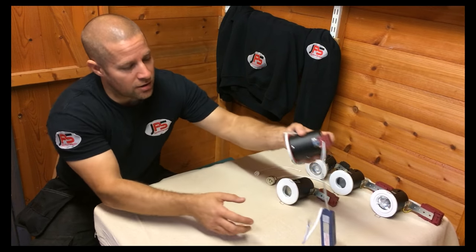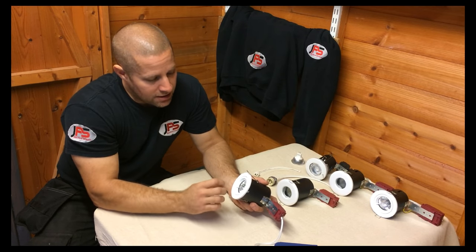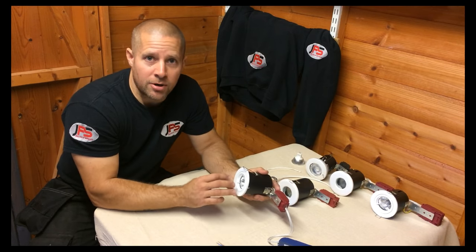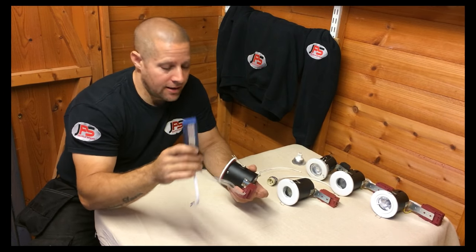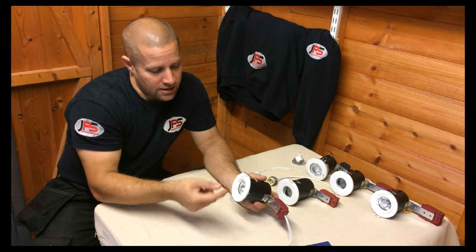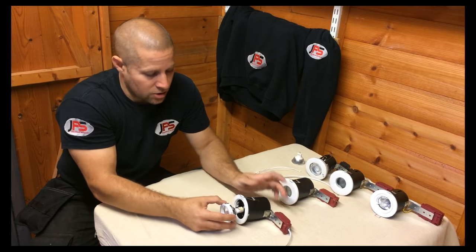So let's have a look at this one — this is a low voltage one. I've got the transformer attached to this one, and the reason I've done this is because sometimes you'll change a light bulb in your fitting, go to switch your light back on and it doesn't work. You'll try another bulb and it still doesn't work. The reason is it's probably a failed transformer. These things tend to get hot, they get too close to the hot lamp and it makes them fail. So if you change the bulb and it's still not working — transformer. So this type is a twist type.